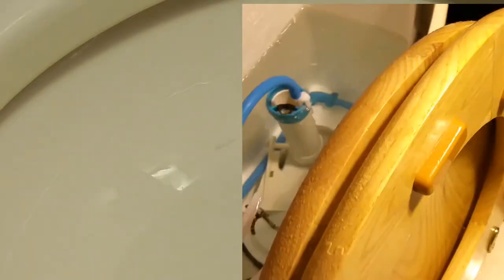Watch the water level rise in the bowl. It should be lower than the line you drew after the toilet has finished flushing. If it is, turn the valve slightly clockwise and flush again. Watch the fill level again. Adjust the mini valve slightly clockwise between flushes to get the water level to, but not over, the line you drew. Once that's done, you are done.